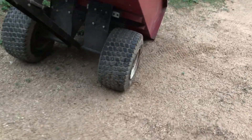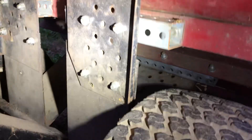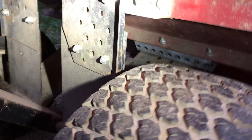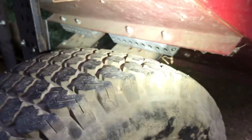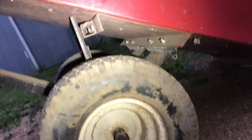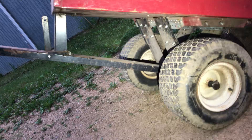I used the stock undercarriage, the under-frame, and I added these plates — I think they were footrests from a garden tractor — plus some tube steel that they sell at Fleet Farm and Menards. Basically, to raise the height, I added tube here and there and a plate to give it some height. That changed the angle of the hitch itself, so it's not 90 degrees to the tongue anymore, but it still works.